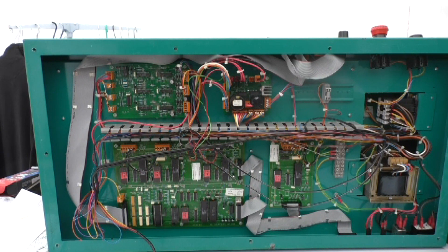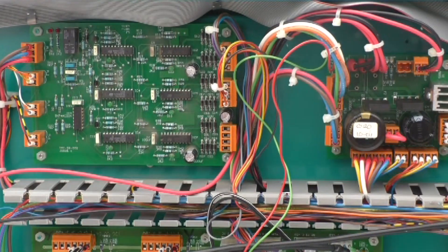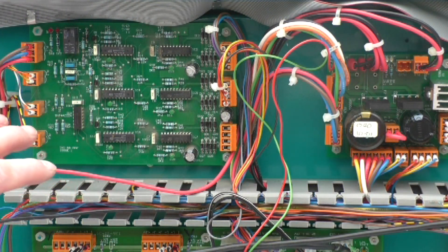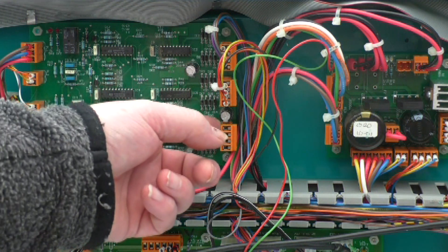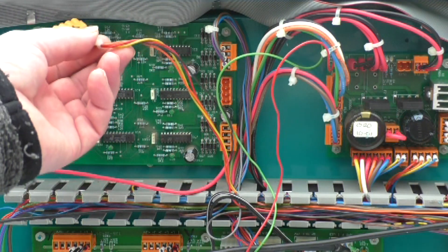The project for today is the stepper motors. This is the underside of the Duet, and currently the motors are controlled by this card. From the looks of it, it's probably possible to keep that card and use it, but if it were to fail I don't think I could get a replacement, so I'd rather stick with the TB6600 stepper motor drivers. It's quite a simple process — we've got Z on this terminal, Y on this terminal, and X on this terminal, and they just simply pull off.